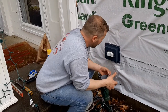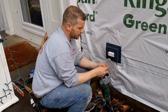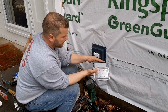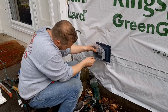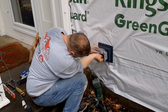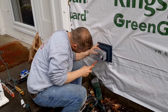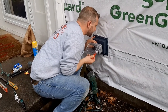They come with their own screws. You're going to pull the screws out of your outlet that are holding it into the box, and you're going to use these two screws instead. It just takes a flathead screwdriver. It has a rubber gasket — foam gasket. We're going to put this right over the GFI, line it up, get these screws into the holes, and it's going to go right through the holes that would normally hold the outlet in.